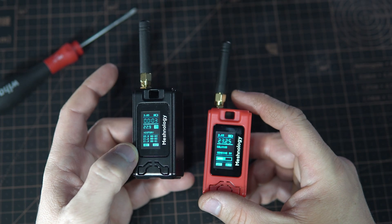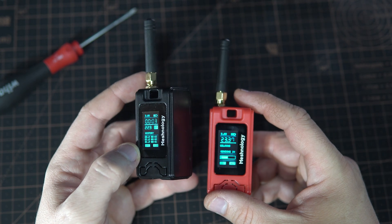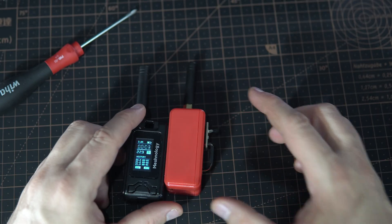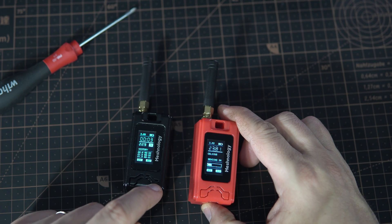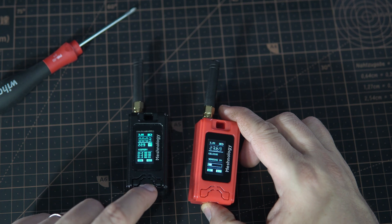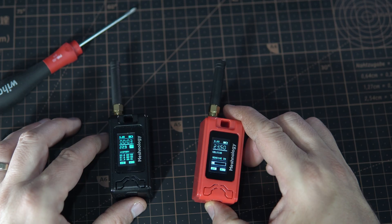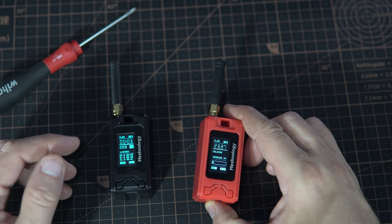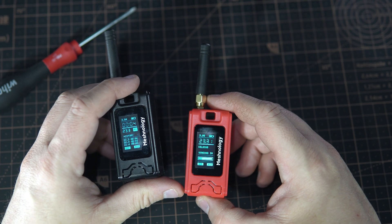For example, I can use these two to monitor small houses where we dry sausages and other meat. But the problem is that these two devices are not in Mesh — this is peer-to-peer communication, which means the range is limited. In my case it is around 400 meters, but that's perfectly fine because I only needed about 200 meters for this project.